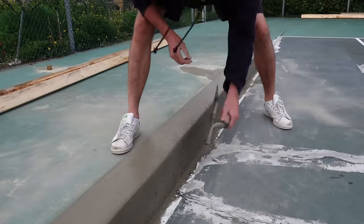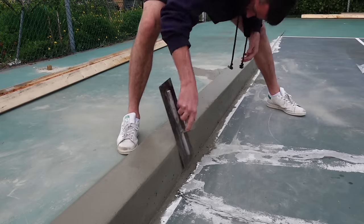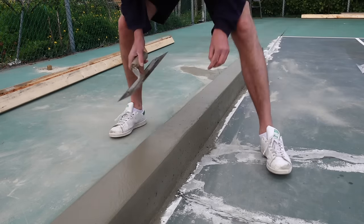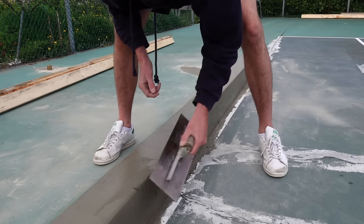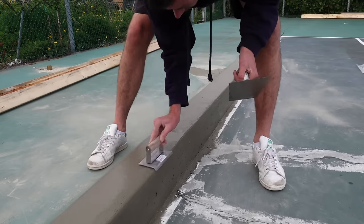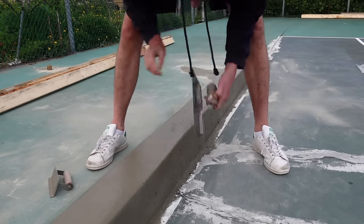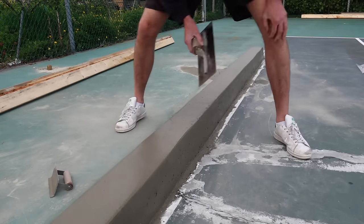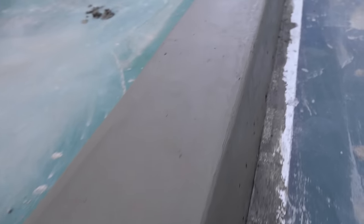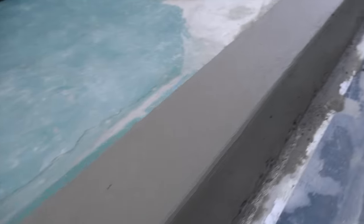At this point the concrete was fully firmed up, and once every 40 minutes or so I would go out, check on it, and start bringing up the fat again — troweling it, trying to make it a little bit smoother. The curb ended up really strong because of it. I think I just managed to compress it all really hard and it hasn't been chipping much at all. Here's a not-very-well-filmed clip of where it was when I decided to leave it — it was getting really dark out and much later than it actually looks in the footage.